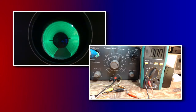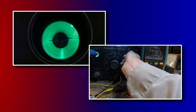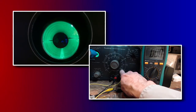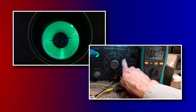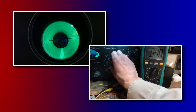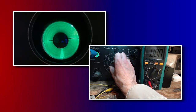So it's supposed to read 0.01. On the digital, it's 0.018. And on the Heathkit, it won't read it. Let's set the Heathkit to 0.01. Okay, 0.01 is going to be in this range. That's 0.5. That's 0.1. That's 0.05, 0.02, 0.01. So that little thing here, I don't know if you can even see that on the... Yeah, you can kind of see it. So this would come out as a 0.02. With the eye not opening. Which is close to what the other meter is reading, 0.018.